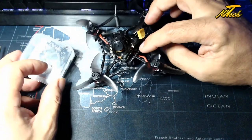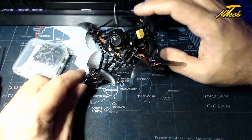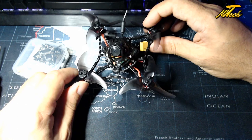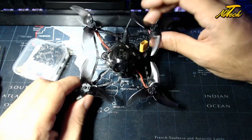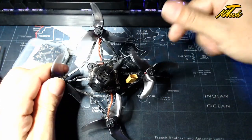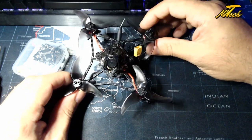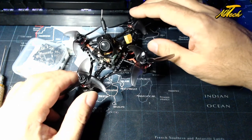I got a replacement board and this one turned up — the antenna was fine, but I was getting no more than about 4 meters of range, which was obviously incredibly frustrating and disappointing. So that one had a duff receiver in it — a bit of a reviewer's curse going on with this one. Anyway, I went ahead and fitted an XM Plus in there, which is why you can see the routing and the two antennas out the two corners here, giving me 90 degrees of diversity. The XM Plus is such a solid little receiver. Obviously we sacrificed some telemetry, but you can still flash an XM Plus to give you RSSI.